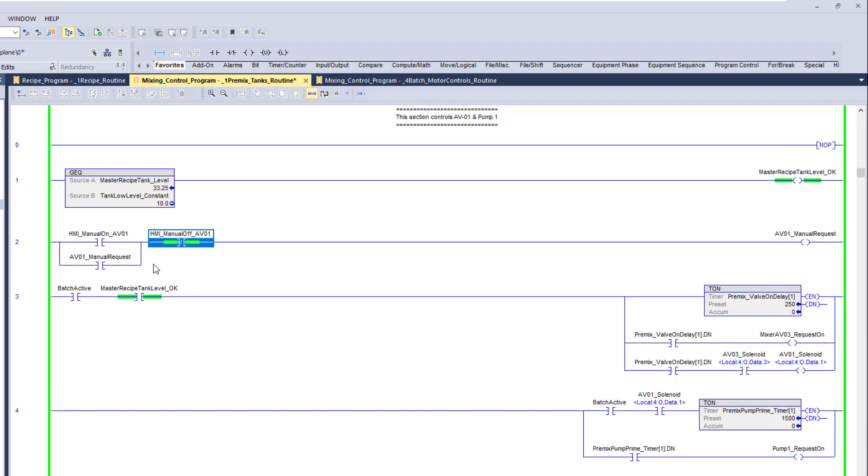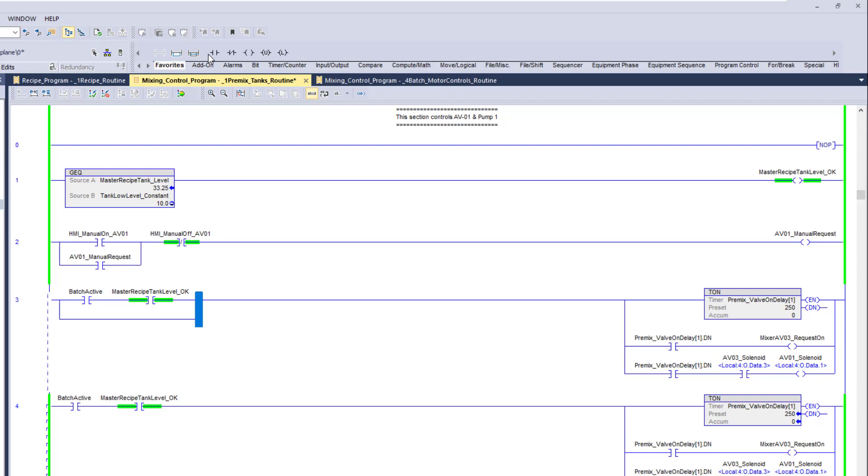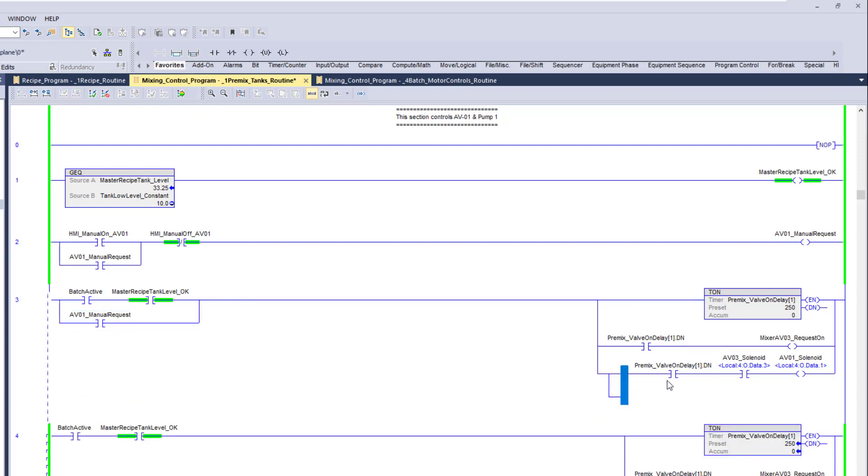Down here I'm going to add these controls — so I'll say if my request is on. The reason I want a request button is because we're going to use all of these in conjunction with an automatic start, and we'll put these in series together like a summing bit. We'll have a summing bit to say all valves are in auto, or all valves are in manual, or one valve is in manual — you can flag an alarm if you try to start with one stuck in manual.